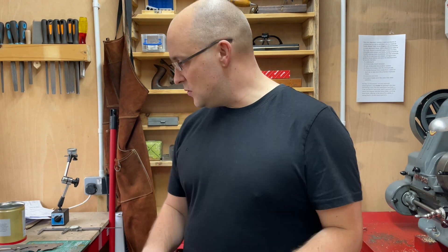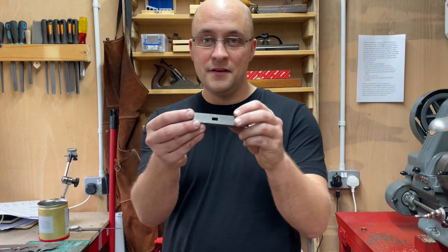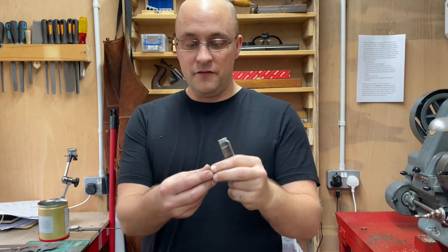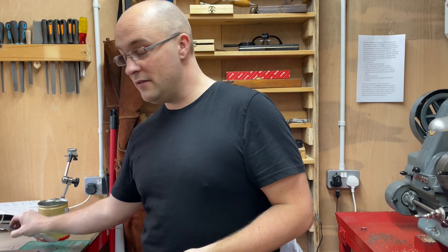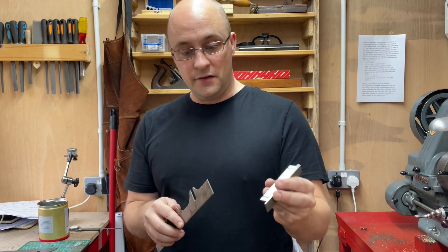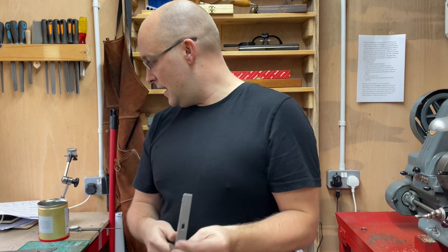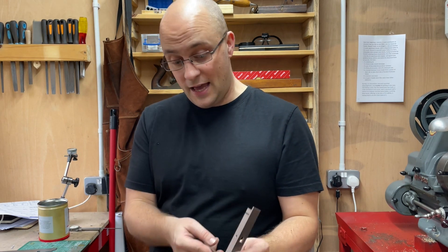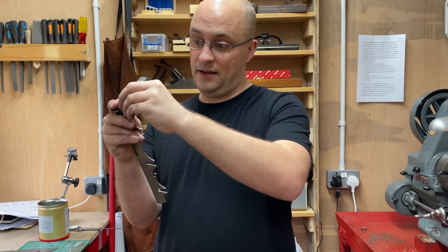To catch you up to where we were: we have a pair of tender beams which have been machined almost completely, and we have some little bits of mild steel angle. We have the tender sides — they slot into a little slot here like so, and then the angles are used to positively locate and reinforce that joint.